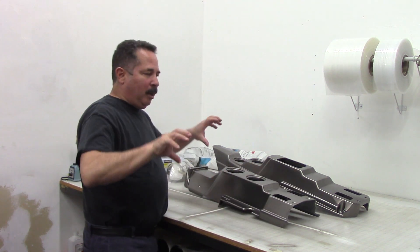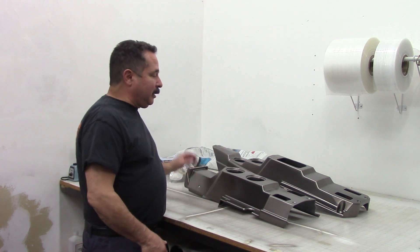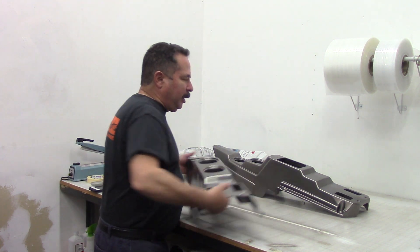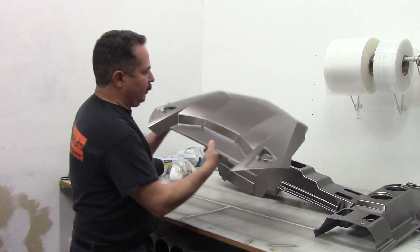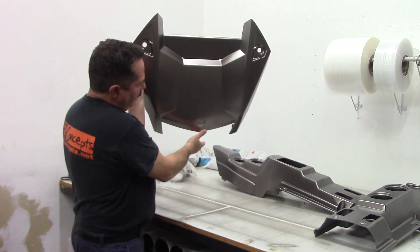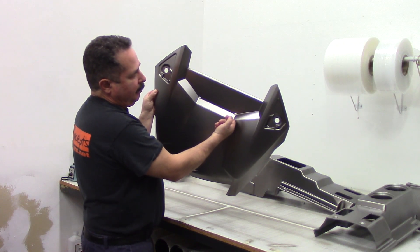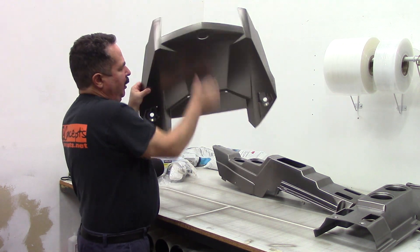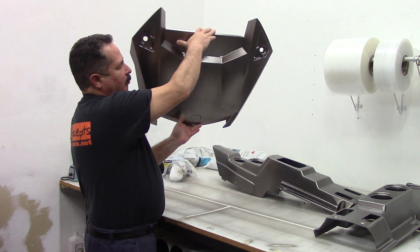You may want to rock the pattern as you're going in. Again, you've got to work on your skill sets — this isn't just taking something and slamming it in a bucket and hoping it comes out well, especially when you get into some of these more advanced parts. Take this hood, for example. The best approach here is to come in like this. Back tape these holes so water doesn't shoot out onto the pattern and destroy your dip. Coming in the other way, you would trap air almost invariably right in here.